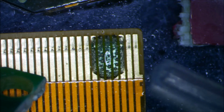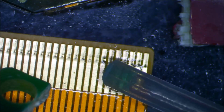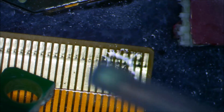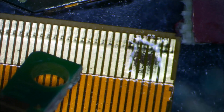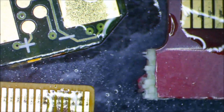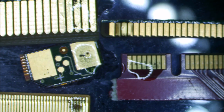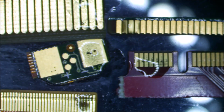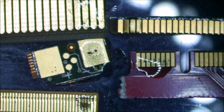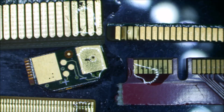And this one here, where we've gone quite green, yeah, so this is already scraping off, so there's very little gold coating. You can actually see the little flakes of gold floating in the nitric acid there. So I think what's probably worth doing right now is I'll leave this reaction with these ones here running for 15 minutes or so, and then I'll come back and we'll have a look at all of these. Let's get this into focus. We'll have a look at all of these 5 again and see how they've gone. So I'll be back soon.